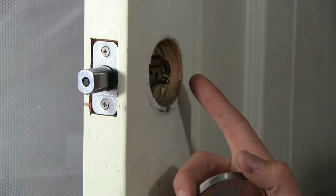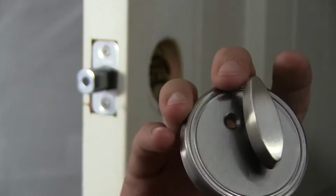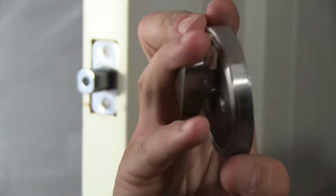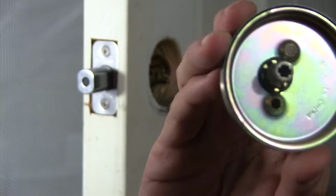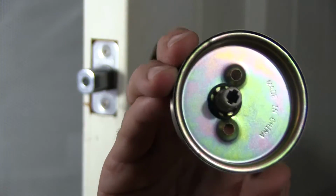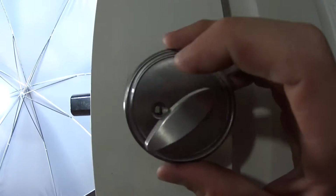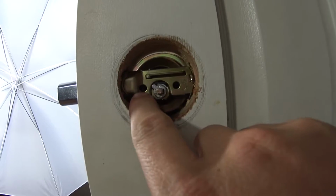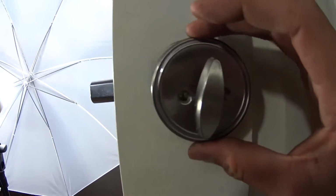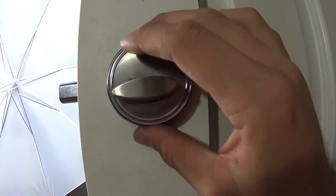So now that we got the key part in, I'm going to put on the back knob so you can lock it from the inside. This guy also has a groove on the inside you see spinning with the knob, and that grabs onto that shaft of the deadbolt you're putting together. We literally just line up the 2 holes you can see here with these 2 right in here. And then as you hit the shaft, you can give it a spin. You usually kind of fall on.